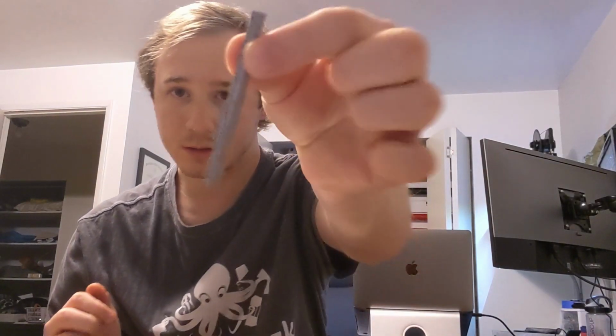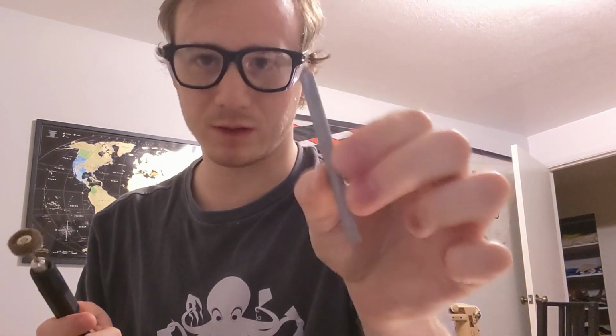And there's our piece, right? It's going to be a little bit rough, so I'm going to take it over to the Dremel and soften those edges. Okay, so now I've got my Dremel with an abrasive brush bit, right? So safety glasses again, and we're just going to kind of soften down these edges, deburr them a bit.